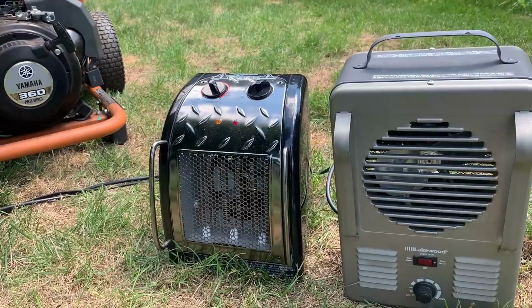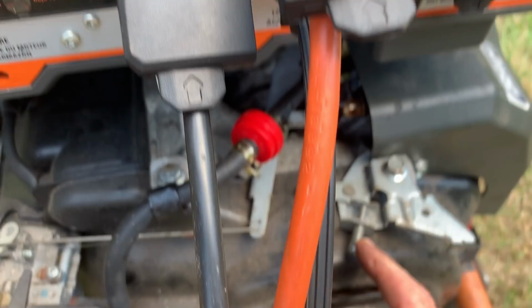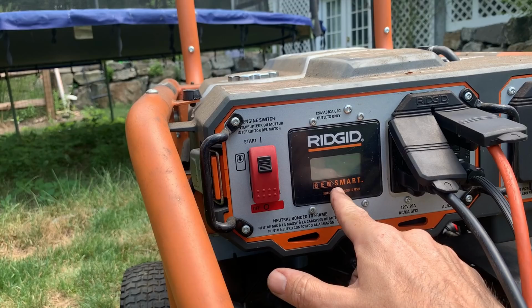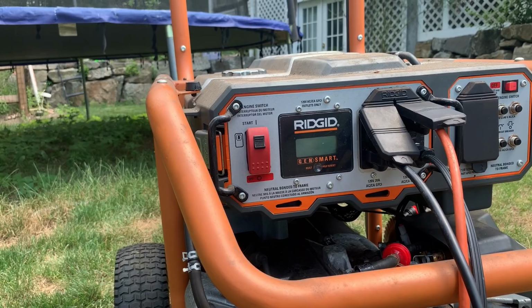So the engine does need to be slowed down a bit, which isn't a big deal. Actually, it's just backing this screw out right here a few turns. So I will start it again, dial that back to about 61 and a half under no load. I also did check this meter here, and all the functions seem to work fine. And only 80 hours on this machine, so not bad. Definitely have a good machine here. Really not a lot to do other than adjust that governor, clean it up a bit, and I guess change the oil and get that battery ordered.